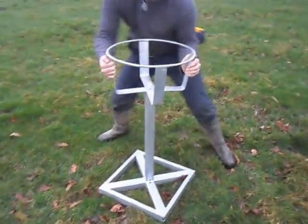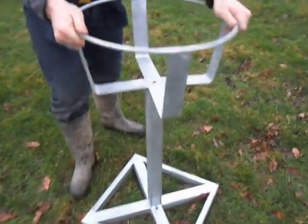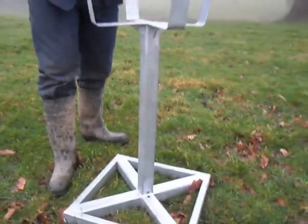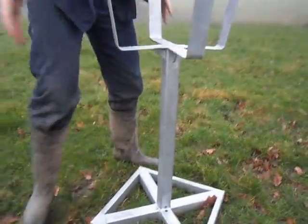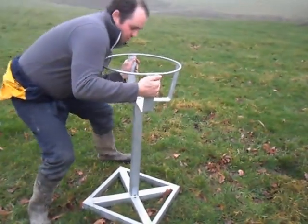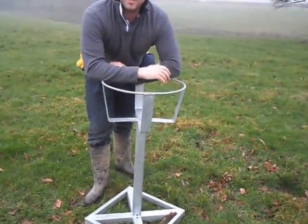The tighter you screw it into the ground, the harder it is. Because of the box section and the pipe, it's got a good bit of whip so you can bulk and rock it back and forth without damaging the stand, and it can't tip it over. All it does is loosen the stand slightly or compress the soil. So you give it a tweak more the next day or next week and it's in harder than it ever was before.